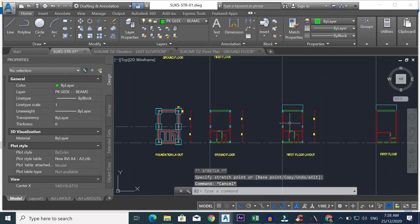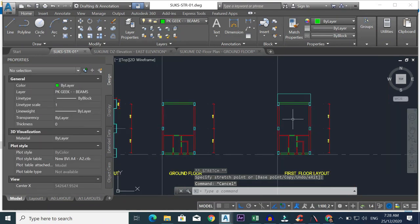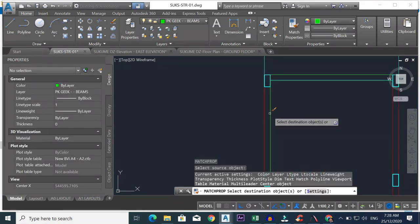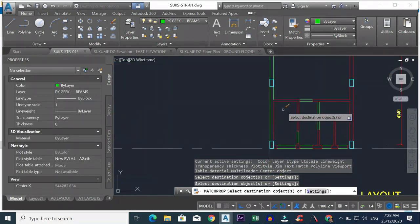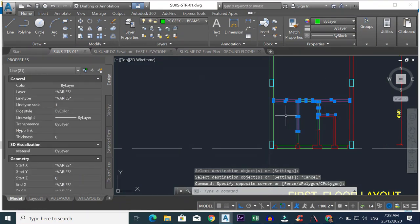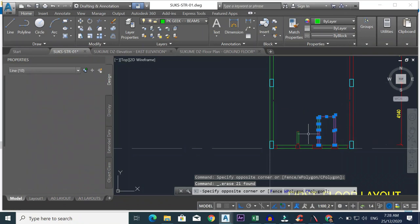Snap to that point. So remember, we are going to have a frame structure. So these are going to be beams. These are going to be beams. And remember, we already said the beams can hide in the walls. But remember, these 115 walls do not do anything. They don't support any slabs, so you can just remove them.